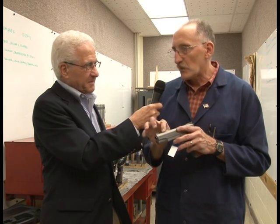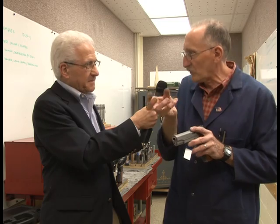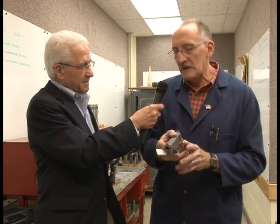Now we've taken it one step further. We put rifling. Rifling is in the barrel and it twists the bullet, right? When you're shooting, you want the gun to torque or twist into your palm, not away from it, because if it twists away from your palm, you're going to lose accuracy. Our right-handed guns actually have a barrel with a left-hand twist, so it drives it into your hand this way. Our left-handed gun has a barrel with a right-handed twist, so it drives the gun into your hand this way. Which is the stronger side of your hand because it's the palm holding the gun.